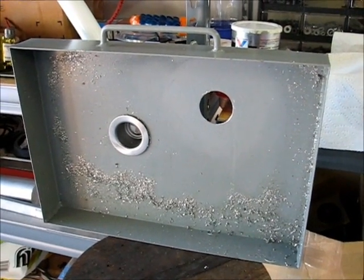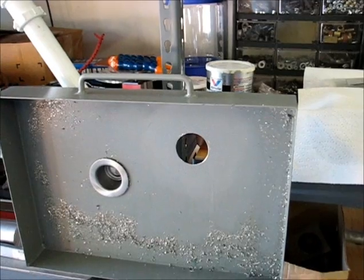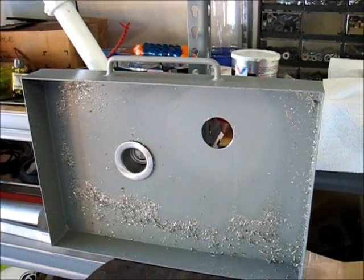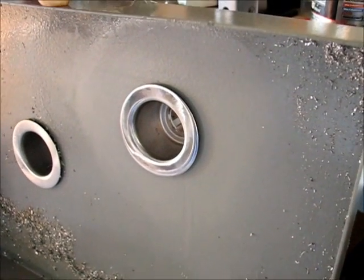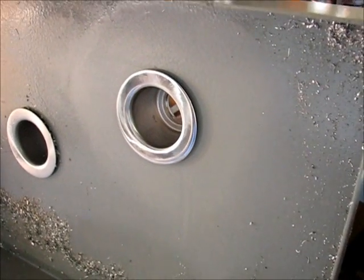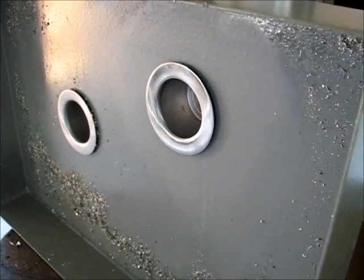The hole has been deburred and everything's cleaned up. I used some brake parts cleaner on the surface to be sure it was nice and clean for the gasket to seal to, so it's just a matter of assembly now. The new strainer is in place. This helps document one of the inherent issues with this design — the gasket goes between the strainer and the tray on the top side, which means there's a standoff distance of about an eighth of an inch or so between the two.